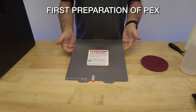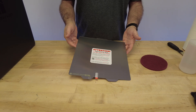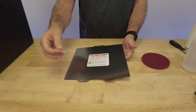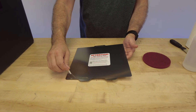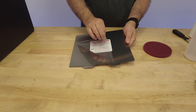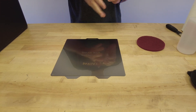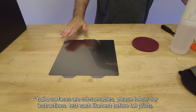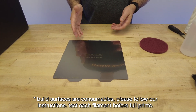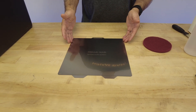So let's get to the first preparation of the build plate. This is the most intensive one - it's going to take four to seven minutes. After this, the maintenance between prints is a matter of seconds, it's really fast. You want to work on a flat surface. You need to remove the protective film - if you're not sure if the protective film came up, take a piece of tape, put it over the corner of the build plate, and lift from there. Once you remove the protective film you have that really beautiful glossy PEX. We do not recommend printing on this - you're going to damage it easily.